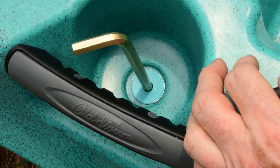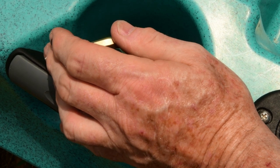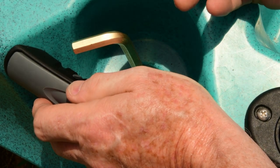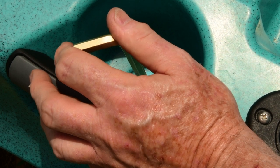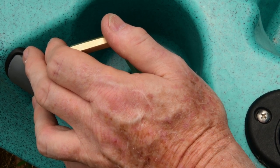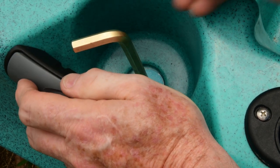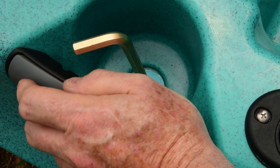Next we're going to put the brass fitting in — again, just hand tighten it. Make sure that you get a turn or two on it until it's hand tight. Next component is the adapter to go from pipe thread to tubing — install that with your hand, hand tight. Next we're going to take our piece of tubing, run it through the hole in the side — it's easy to do that way. With the tubing sticking out, insert it in there until you feel it bottom out. Take your lock keeper, slide it in place — your tubing is now locked.